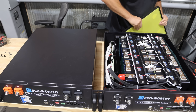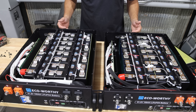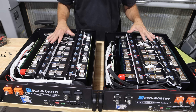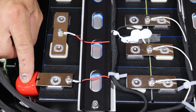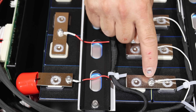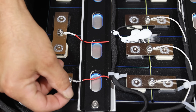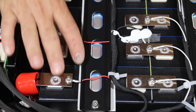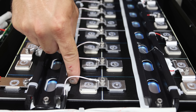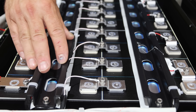Opening up both batteries, at first glance they look really similar — the way the cells are arranged and where the BMS is. Looking at the old battery, the flat bus bars are laser welded on, each with a voltage reading for the BMS, and there are four temperature sensors. One key difference is the cell holders: in the old battery they're only about a half inch tall. In the new battery, the hold-down is almost an inch tall — that's why the case is taller — giving the batteries much more support.